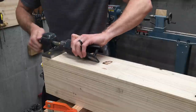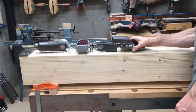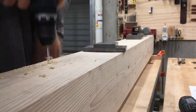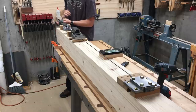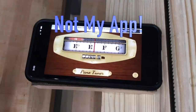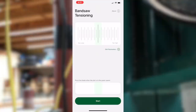The apparatus is the answer to how can I get a tension measurement I can trust. It anchors a length of bandsaw blade to a strong wooden post on one end and a digital scale on the other. So as I tighten down on the blade, I can know very precisely what tension the blade is actually experiencing. I can then measure a corresponding frequency of vibration for that blade, and if I do this for a range of tensions, I can fit a correlation to convert any frequency into a tension. And if I do that process for a whole lot of different bandsaw blades, I can sort out what blade parameters are important and how they affect the frequency-to-tension correlation and account for them in the app.